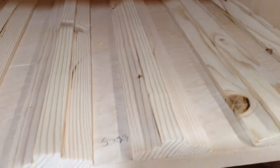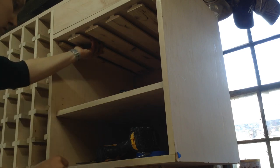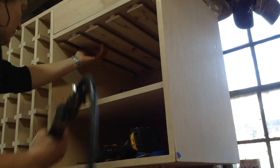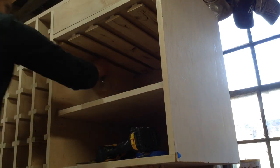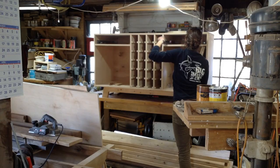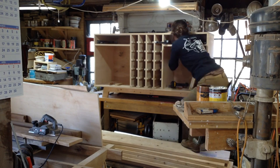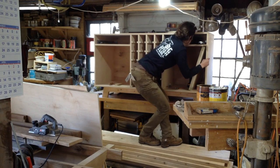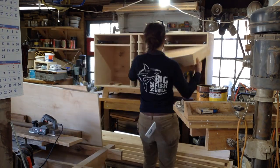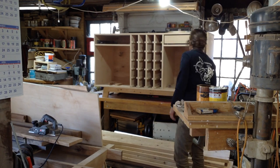I could just transfer these up to the top of the cabinet. For the time being, just to get the alignment in place, I'm using some brads to hold these in place, but I'll countersink some screws later and permanently attach them. You could see the wine glasses work. For the shelves, I'm using undermount drawer slides — these are my drawer slides of choice nowadays. I just find they open nicer, I like not seeing the hardware, and I find there's more forgiveness in the final product. That's just fitting the drawer box into the cabinet.